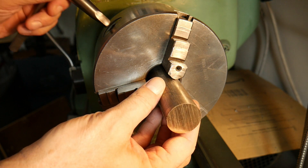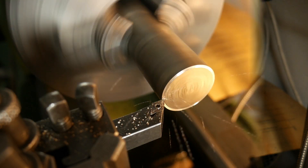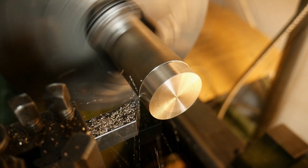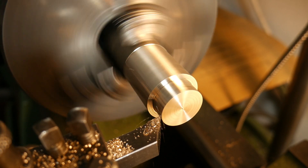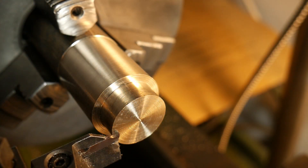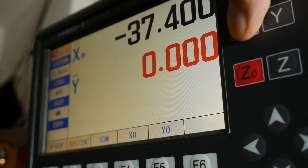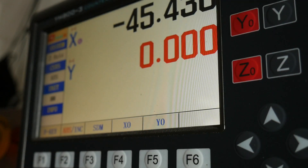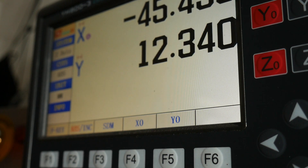Then I put the bronze bar in the spindle and after closing it I face the frontal face of the bronze. After that I turn down the external diameter — this will be the first bushing. I turn down the diameter to a little more than 24mm. I make the zero with my cutting tool, and as you can see the 2mm is the width of my cutter. After zero I go to cut to a 13mm length. This is the first bushing.